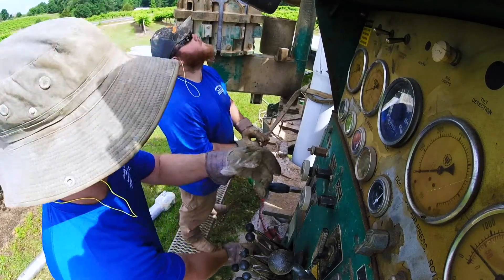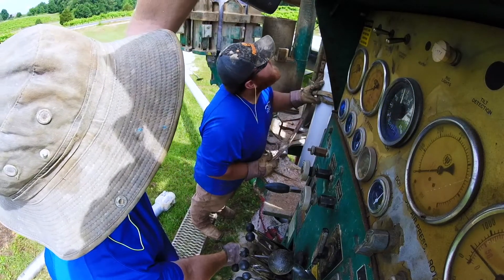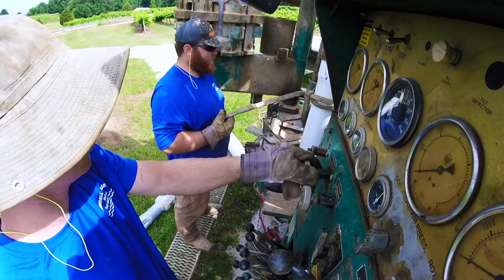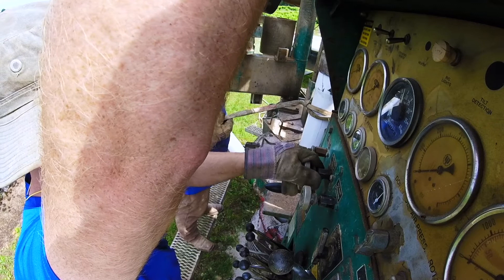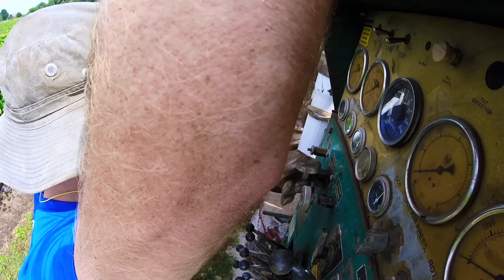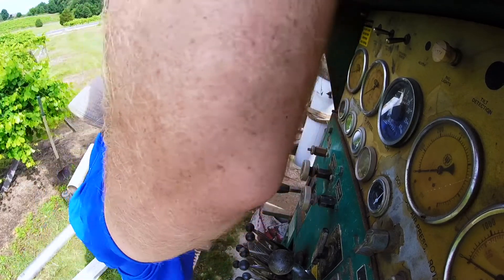It's probably about six feet above the ground right now, so I'm going to use the drill rig to help push the casing the rest of the way into place before we cut it. The rig is sitting on top of the last piece of casing — I'm adjusting the pressure of the drill rig so it's not stressing the casing but putting enough force down to push it into place. I've got a little pressure on it and it doesn't want to go down anymore — it's secured in place.